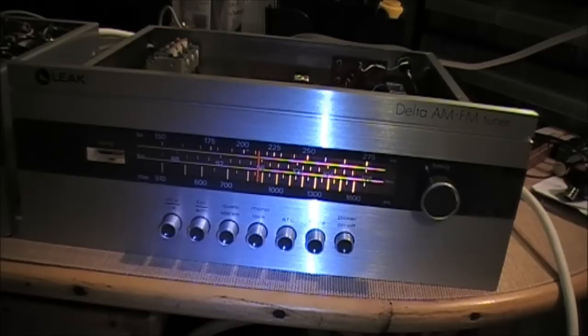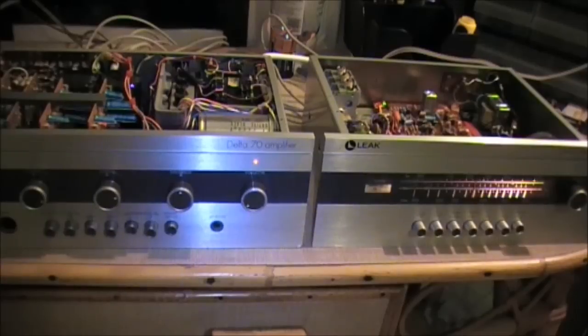However you get this disparity, the idea is that you'll have a slight delay between the two signals, and that's meant to introduce a widening effect in the signal. Therefore the two outputs you have are mimicking a stereo effect. So in short, Quasi Stereo takes a mono input signal and produces a pseudo stereo two-channel output. So there you go, two vintage hi-fi units with easily accommodated weaknesses and significant strengths that stack up well today.